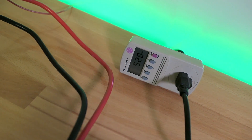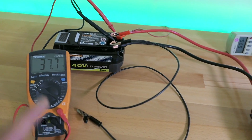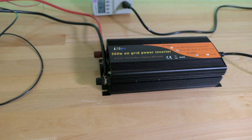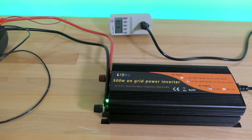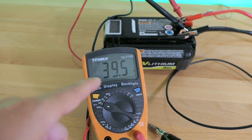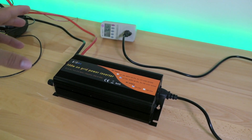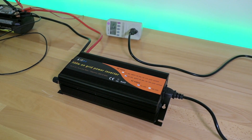Wow, it's pushing itself to the limit. I'm guessing it'll go back down once it heats up, and our battery voltage is dropping quite quickly. I'm not going to let this run too long. It's still pumping 520 watts, and as the voltage drops, output will drop too. The fan isn't on yet so it's not hot enough. We started at 40.1 volts and it dropped fast. The terminals are warm but not hot, so the connection looks good. With about 500 watts pushing into the grid, I should be able to see a difference on my utility meter — I'm really curious about that.